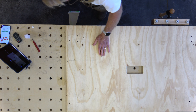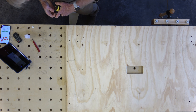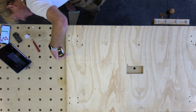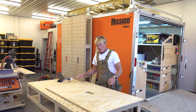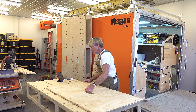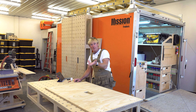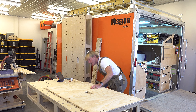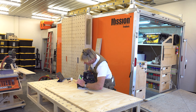You can't see this with the camera, but they are hovering above the bench surface — it looks like about five millimeters or so. This is an 18 millimeter piece of material and I know that the material is about five millimeters above the bench. So I'll set up my saw to cut through the 18 mil a little bit more — I'll set it on 20.